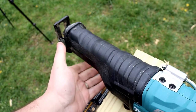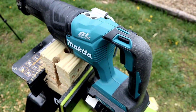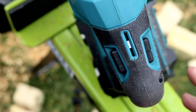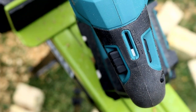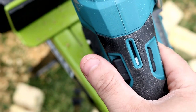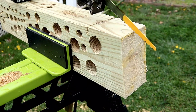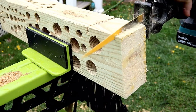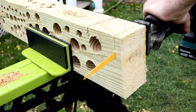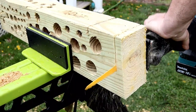The one thing I noticed right off the bat was really how comfortable this thing was — that is what I'll give credit to Makita for all day long. They might not be the most powerful or quickest tools on the market, but they are definitely smooth and comfortable to use. Another feature I really like is not only the variable speed trigger, but you have two settings: number one is a lower speed, and number two is your quicker speed. This thing only weighs 9.3 pounds with both batteries in, so super light. You get a one-and-a-quarter inch stroke length, 3,000 strokes per minute on metal cutting, and 2,300 strokes per minute for wood.